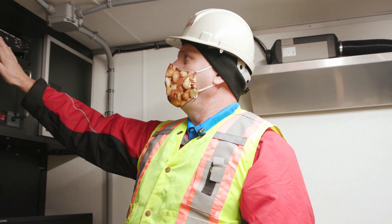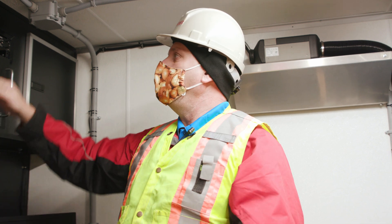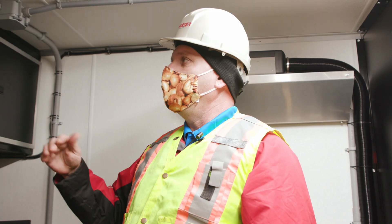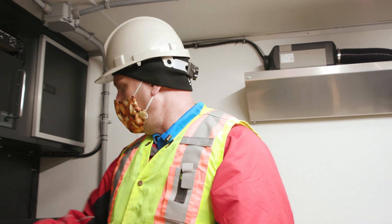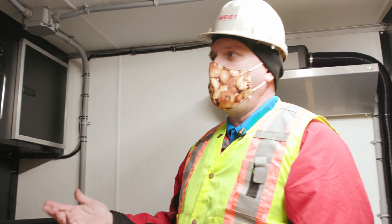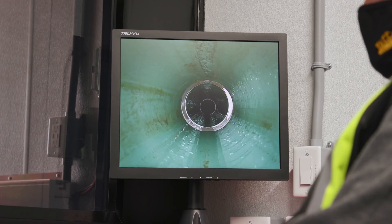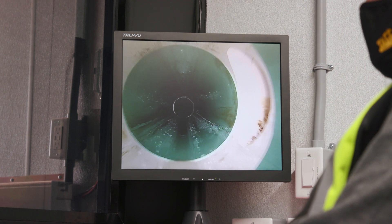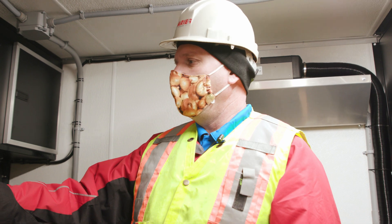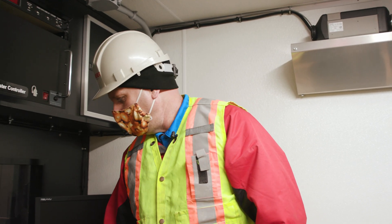We do have a text overlay, so this is where we find out how far down the line we are. It also links directly with the report generating software, putting various messages up on the screen. On this monitor here we have an image of the actual pipe — this is the actual viewing monitor. The other screen is more used for control and report generating, so we like to separate those out.